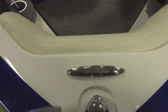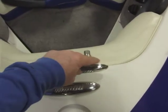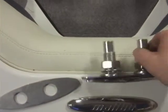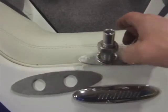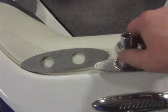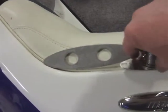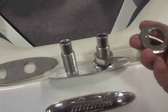We use a deck-mounted bow cleat to hold the bow strap in position over the top of the bow. The cleat is a very simple unit — it comes with a backing plate to reinforce underneath. Just remove the nuts and washers, drill two holes of appropriate size, put the backing plate on, and snug up the nuts. It's a very strong and simple way, and you'll find there are actually other uses for this cleat as well.